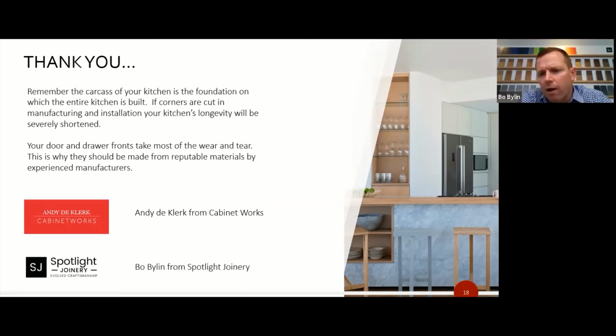Andy, I think that speaks for the veneer over edge doors, and generally, should we have a big project that comes in, we would contact our supplier, a company like Veneercraft, and we'd actually ask them to reserve 250 to 300 square meters of a particular bull, all those leaves to one side, and then we would say, keep this for that particular job, so that they know every time that job comes in, they would use that particular veneer. That veneer does change as you start working your way through the bull. I mean, the grain changes and things like that. Sometimes we do tend to get client sign off.